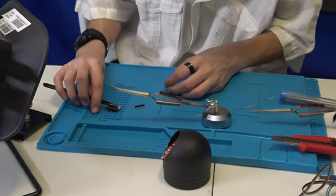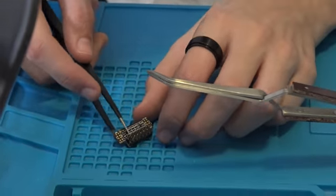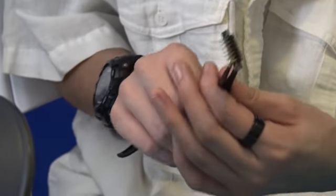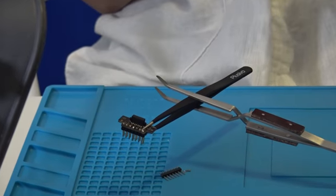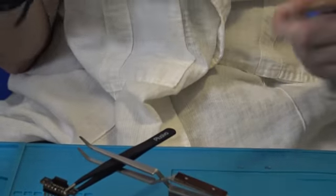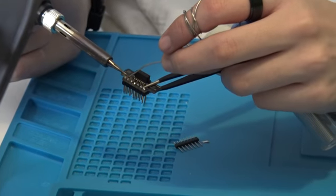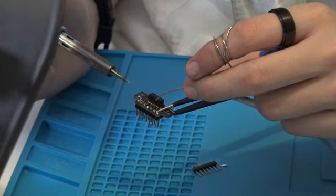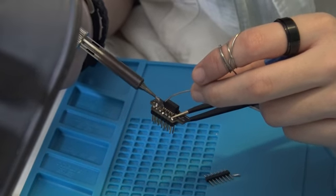I will take them. I will place them in the board. I will then use these tweezers and take the clamper tweezers and clamp these regular tweezers, because these regular tweezers will be better for this. Because the clamping tweezers are a bit too wide to get to the other end. As I struggled. Alright. Now, let's get this all soldered up, and then we'll be done. Now you just take solder, just a bit, not too much, not too little, just a bead of solder.